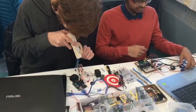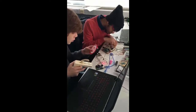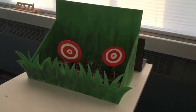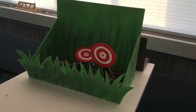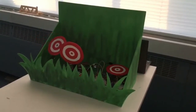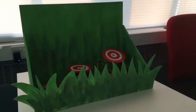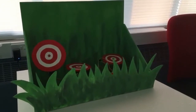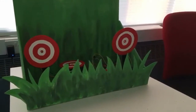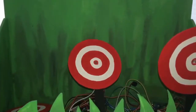To counteract this we switched back to using two Arduinos — one to handle the servos and the other to handle the photoresistors. The Arduino controlling the servos randomly selects how many servos to switch on, then randomly selects which servo or combination of servos to turn on and off and in which order. The photoresistors have to be calibrated for the room they are in and can accurately detect when the laser increases the luminosity on the photoresistor.